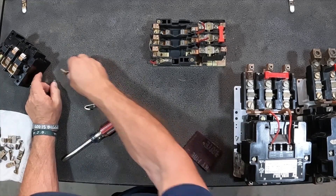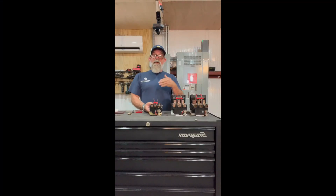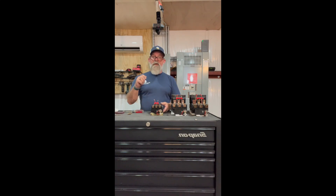Now, we're going to get a little deeper in a couple of our other videos, but on this particular one, these are simple maintenance points. If you've got a little bit of maintenance experience — obviously you want to de-energize it. You do want to pull it out of the equipment, out of the motor control center bucket or the standalone starter enclosure. Pull it out and do that service at a desktop. It can be done in the enclosure, but use extreme caution that you don't have control power still on for your coil, because that could be a problem. Always isolate and get rid of control power.